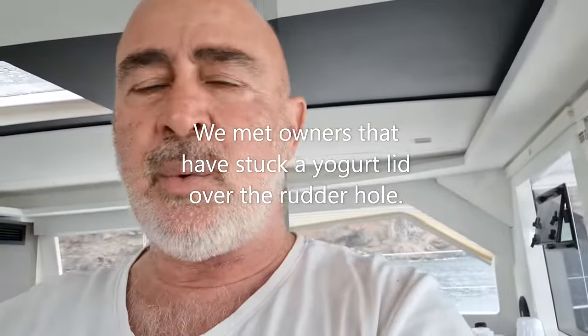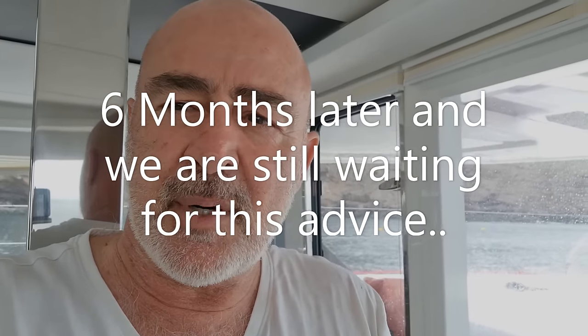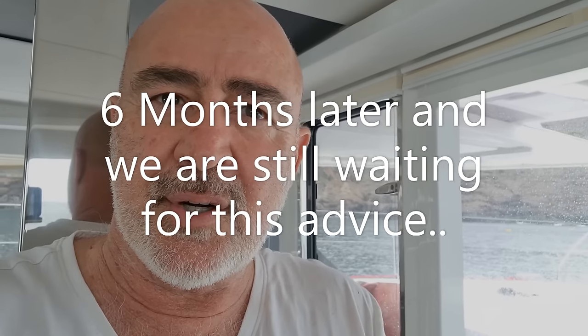Potentially we were going to screw this one on. We're very thankful we found that spare cap. We're going to request another two because they just fall off - we've already had a couple fall off. We'll try to take advice from Robertson Cane as to how to secure it with hardware rather than just sealant - perhaps a screw. The material below into which the screw would go is aluminium, so we'd need to have it tapped properly for the screw to hold the lid on properly.